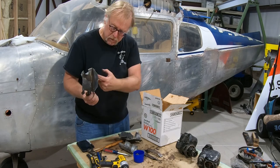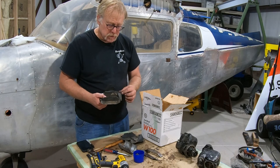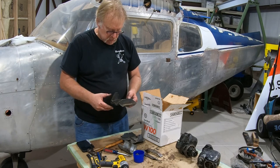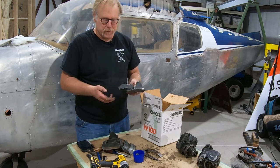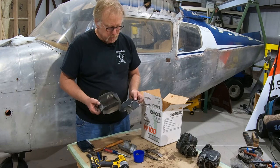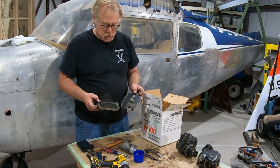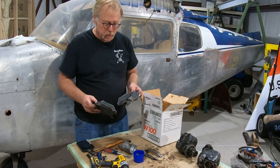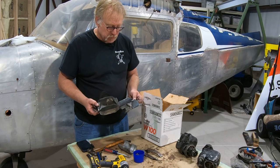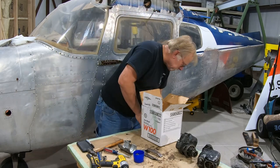A lot of times you'll see these will crack in here, they'll chafe. This has a whole bunch of RTV, kind of a cobbed up job. A lot of people get hung up on the air and it's got to be RTV and all that. That's just a FOD issue. The other thing is, think about this. A lot of folks are worried about the air. The air is coming in here into the front of your engine at 150 miles an hour. It's not going to hang around. It's going to want to get out. So putting this on here is kind of a false economy. If that's how critical your cooling is, you have bigger issues. Trying to pack 150 mile an hour air into the front of this thing, it's got to find a way out. You don't really want to capture the hot air in the engine between the cylinders. So yeah, you want to force air around the cylinders, but at 150 miles an hour, it's going to figure that out. So I don't know. That's just something that I always thought was funny.